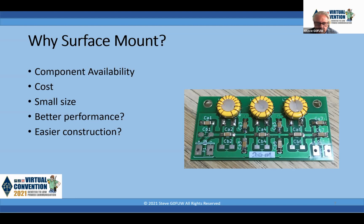which I think is a brilliant thing, and I've used it more or less since I came into the hobby, and I had one in my HW8 if I remember rightly. It's a great mixer, and I've seen it in 2 different packages, and as far as I'm aware, I believe Pete when he says you cannot buy the leaded version as a new device anymore. You can get it in surface mount configuration. So it's the same mixer, it's got the same properties, it's just in a smaller package, and you have to use the surface mount technology approach to use it. But it works just as well, and there's absolutely no reason why we shouldn't be looking at that.